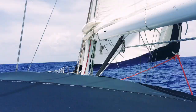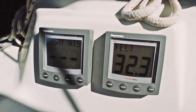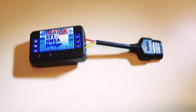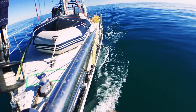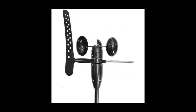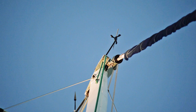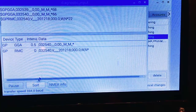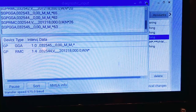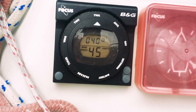I've made a few improvements since my last video. We've done away with some analog instruments and purchased Raymarine cockpit displays which work on SeaTalk and connect to our autopilot very nicely. Using a small SeaTalk to NMEA bridge device, I'm able to get all of my NMEA 0183 data out of the SeaTalk network and into my Raspberry Pi. I've also upgraded to a Digital Yacht WND-100 wind instrument — a masthead anemometer with its own built-in NMEA 0183 output signal. This feeds wind data directly into the Raspberry Pi, so now in OpenCPN I can see all wind data on screen, whereas before I only had a cockpit display and couldn't see it on mobile devices.